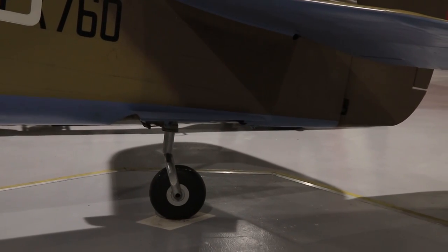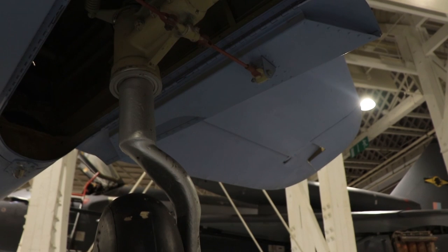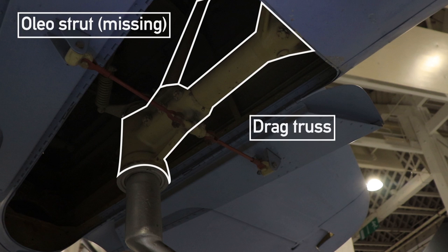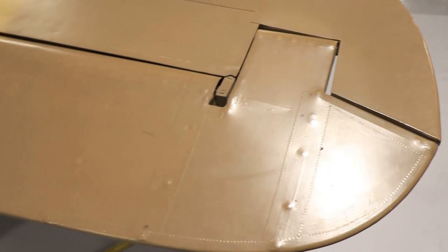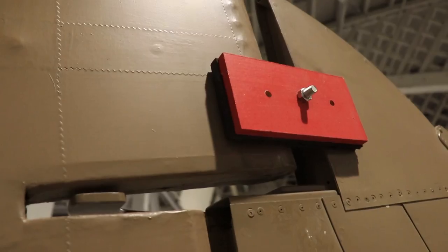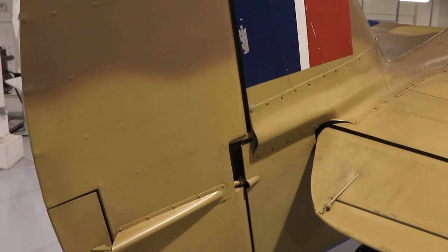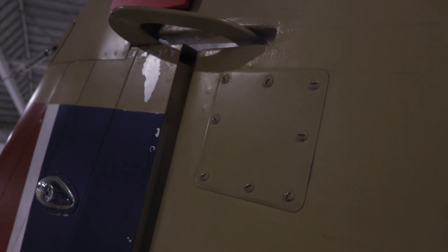Additional panels allow access to the tailwheel and the rudder control system. The tailwheel can swivel and is retractable — originally it would be 12.5-inch Firestone tyres. When retracting, a piston above the wheel moves forward, pulling the oleo strut and lifting the drag truss by about 60 degrees, so the wheel swings up and backwards while the doors are pulled closed. The tailplane is simple and you can actually see the balance control of the canvas-covered elevator through the square-shaped cut into the tailplane. The trim tabs are clearly visible, as are the small rods that set the trim deflection based on pilot input. The rudder hooks slightly into the vertical stabilizer, and you will find a navigational light here as well. The yaw trim and yaw control rod can be found on the lower half.